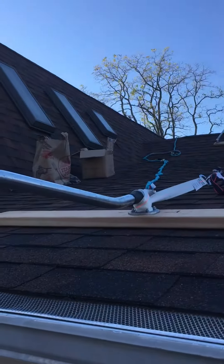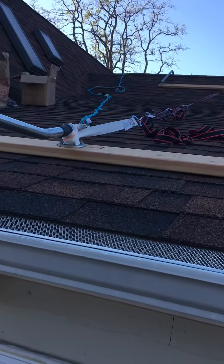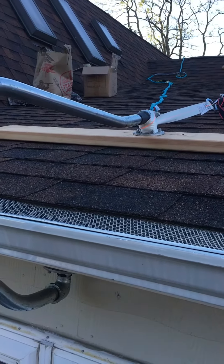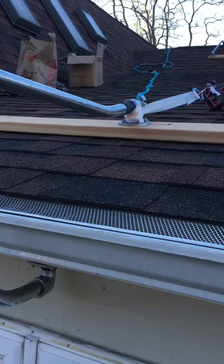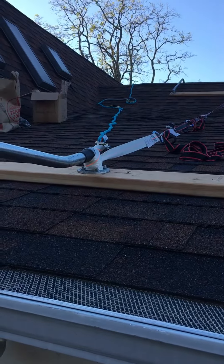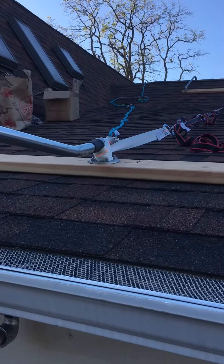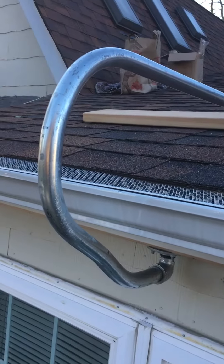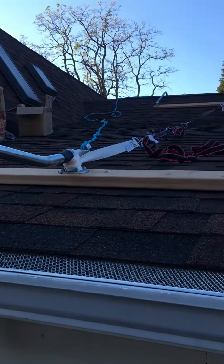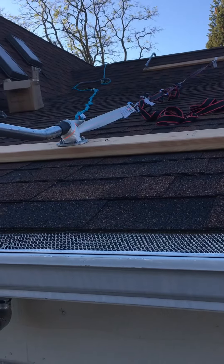You can see how it is attached to a four-foot board — a two by six — which then attaches to the lifeline that I use when I wear my harness for working on the other side. This particular eave hook, as I guess all eave hooks need to be, must be held in position so that when you tug on it with the lifeline there's no slack.